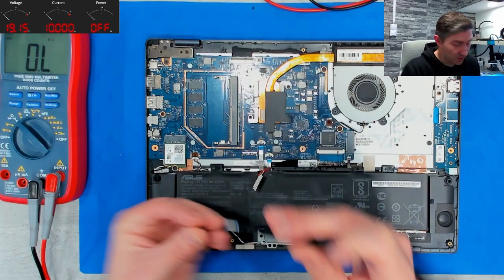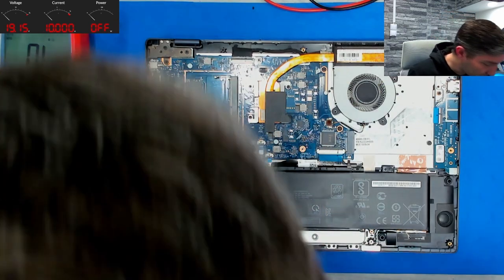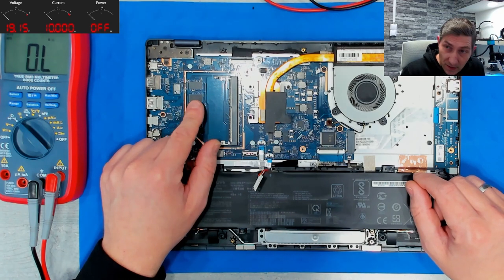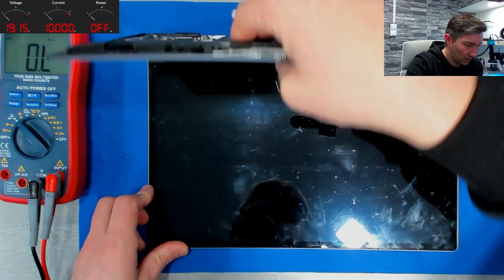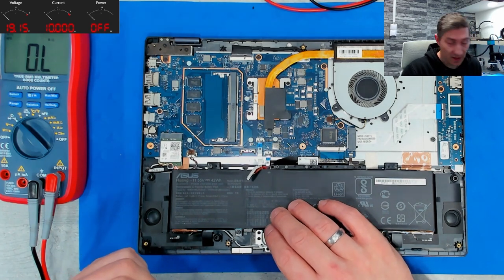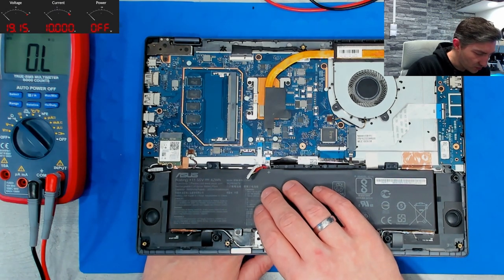When you're looking for something wrong with the memory, you're looking for a signal like DRAM reset, whether it is high. If not, probably something wrong with the memory. So basically we want to find out whether DRAM reset is high and whether platform reset is high, because if they are not high, the requirements for a good power on self-test are not met. So there is no point to flash BIOS or something else, because we have a board issue without platform reset being deasserted. Okay? So, memory is removed.